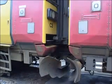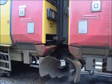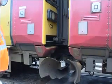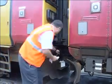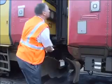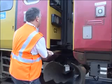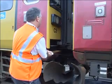If the units still won't uncouple, you'll need to get someone to help you with the emergency uncoupling rod. When the person assisting has located the end of the rod into the uncoupling lever, ease up. Now the uncoupling lever can be pulled back, releasing the couplers. You can then move the units apart.